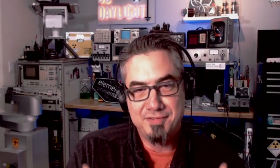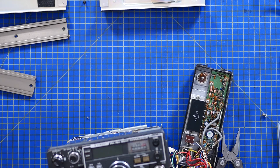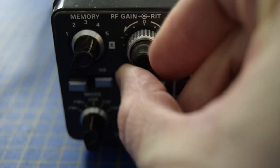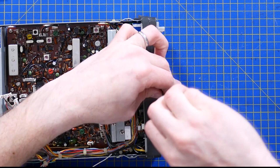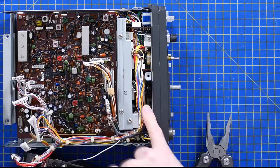The SSB is a single conversion process where that only happens once. There is usually a VFO — a variable frequency oscillator — which is what that big knob on the front, the tuning knob, is connected to, and that feeds those mixers. Some of these knobs just pull right off and some have grub screws or set screws and I really can't tell which one's which. I absolutely love coaxial knobs — really common in the older stuff. There's a very pleasing encoder here, and I assume it's electronic — but I think that might be an optical encoder, like an old mouse. A lot of the ham radio stuff usually has a nice optical encoder with a little disc. I can see the black wheel with the notches cut out of it.